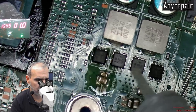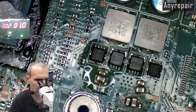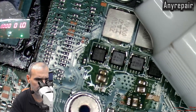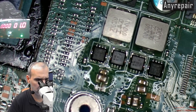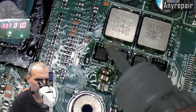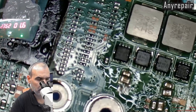We will check with alcohol too. Yes, it is definitely the capacitor. Look for the alcohol drying on the bigger cap on the left.